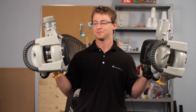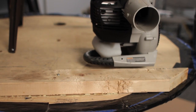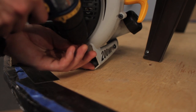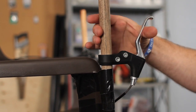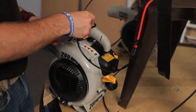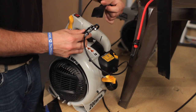Let's look at leaf blower propulsion. These little blowers can push up to 400 cubic feet per minute each, which should be enough to overcome the inertia of me and the hovercraft. I had to attach a 2x4 to the back to get the leaf blowers angled properly, then attached the blowers with screws and metal straps. Make sure your screws don't extend through the plywood or you'll risk ripping your skirt. The cool idea in this system is the steering — I rigged up brake calipers from an old bicycle to the armrests of the lawn chair. They'll control the throttles in the leaf blowers. When I squeeze the hand throttle, the calipers will squeeze the trigger on the leaf blower. This part was a bit fussy; I connected the calipers to the leaf blower with duct tape. They have to fit around the trigger so that the throttle opens when I squeeze the hand control.